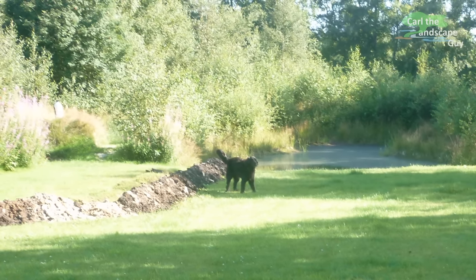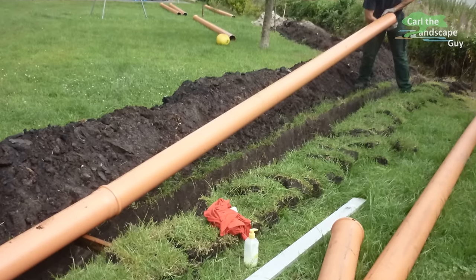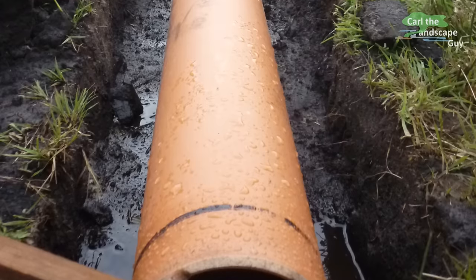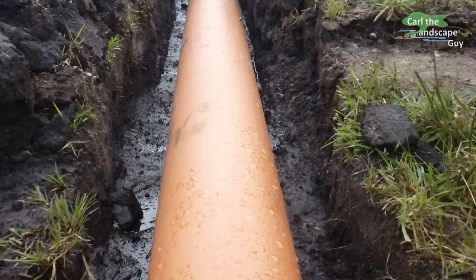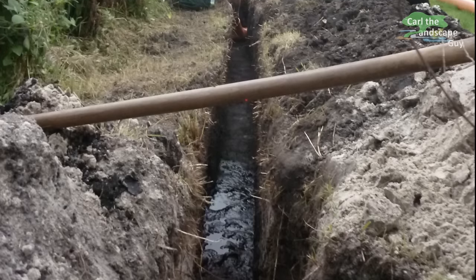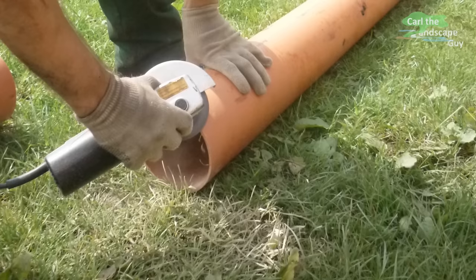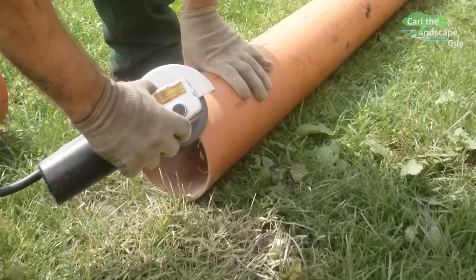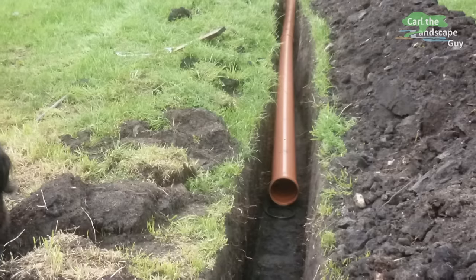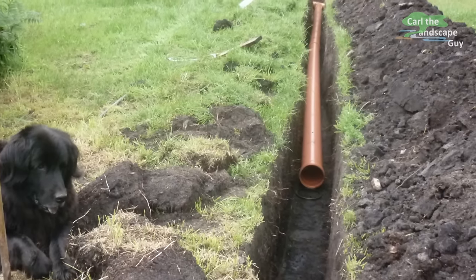In order to minimize the water level fluctuation I started by connecting the pit to the closest rainwater ditch. For that I used about 250 feet of PVC drainage piping, 6 inches in diameter. The pipes were installed on a slope so that the water from the ditch would flow into the pit. I chose only a small slope for the piping so that if the pond is filled up, water can flow backwards into the ditch without overflowing the pond.